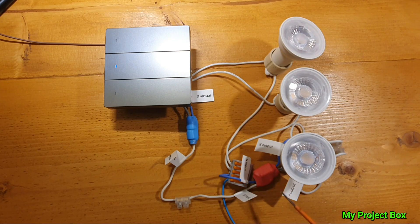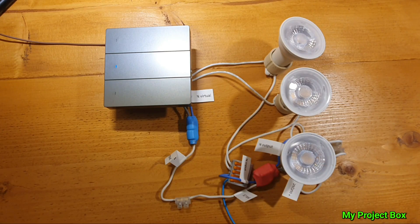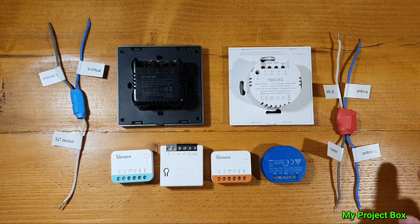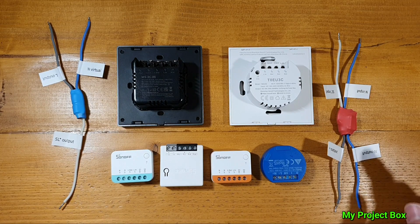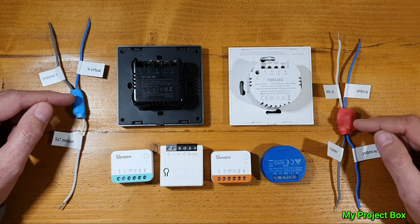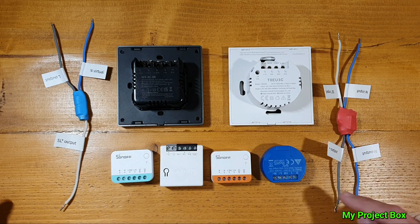This version is more robust and improved — you can have multiple light bulbs per channel or more powerful LED bulbs connected. These little modules work great with all the devices I've tested here, including various smart light switches and smart relays. Others have also tested the previous version with various other smart switches including some Tuya-branded types. I must stress it doesn't work with all of them, and with the previous design some people reported having to reverse the diodes. I can confirm they definitely work with Sonoff products and with the Shelly One.